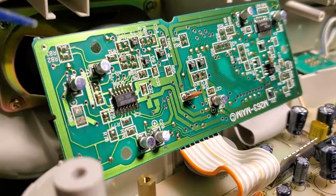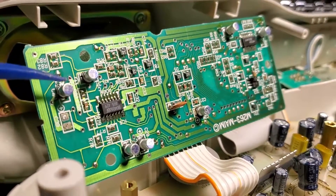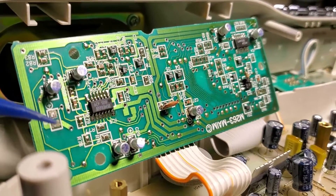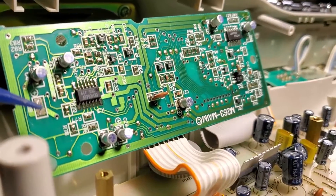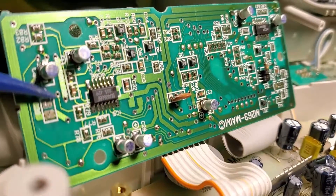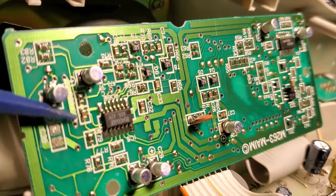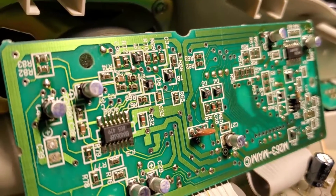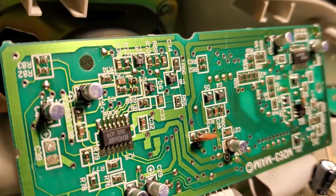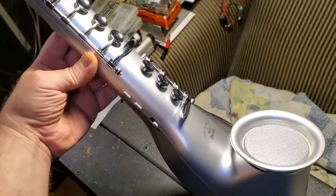Here's capacitor C39's area right here — it's an SMD component like this, so you just twist it off and it'll break right off. I clean the area with a little bit of alcohol, and you use these two small holes here and here to place a new through-hole capacitor instead of having to use an SMD component again. It's fairly easy, and now here it is repaired.